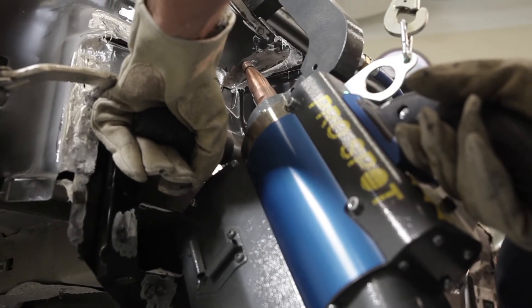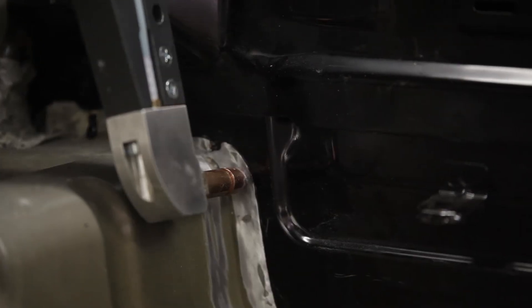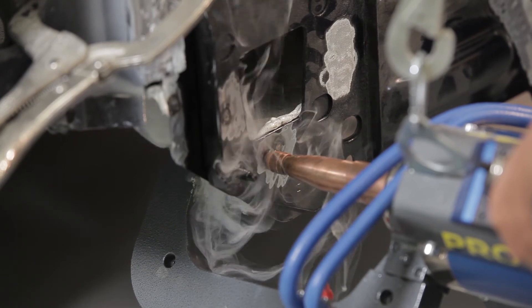You have welders that have both an automatic function and a manual function. A lot of the automatic functions ensure that a technician consistently produces a suitable weld. But the manual mode takes into consideration that if you have a power supply issue, you can sometimes modify the settings to work within that parameter.